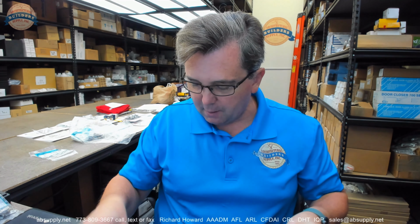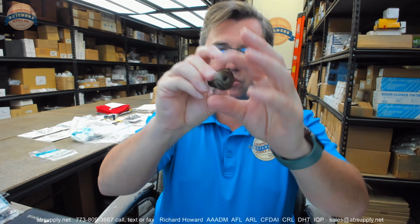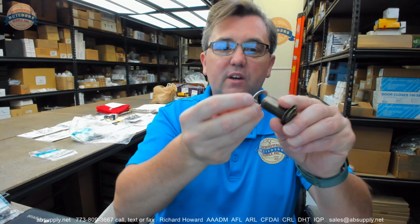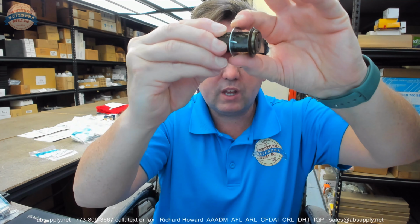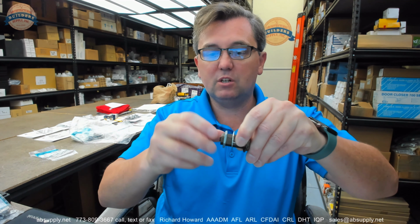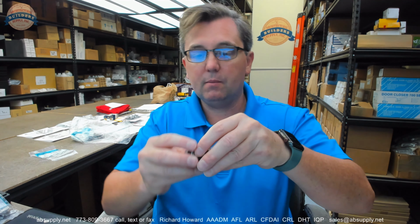Before you put your cam on, you'll want to install your collar or your bezel if you're using it. This will come with a wood nut. That's an anti-rotation device, that when you install it, those prongs, there are 2 of them, will keep that from spinning. And then you have the installation nut. That will go on. You'll tighten that down for your installation to be complete, and then you'll bring your cam to the back side of the unit. That's how everything on this installs.